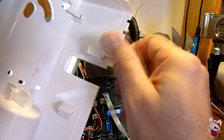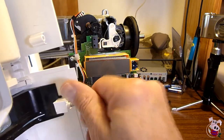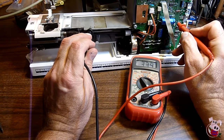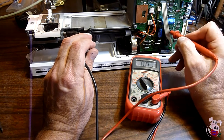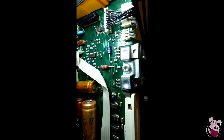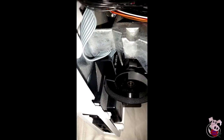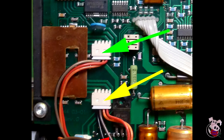For tracking purposes, I usually put the screws back in the holes they came from — this eliminates mixing them up when reassembling. At this point, I plug the unit in without the control panel to measure the voltage on the capacitors. Now is a good time to take a lot of pictures. Make sure you get all of the connectors, where the wires are coming from, as well as the screws you'll be removing. Also get pictures around the right side where the speed controller is. Before removing the connectors, note that these two connectors can be confused when reassembling — they're the same size and I put them backwards several times.